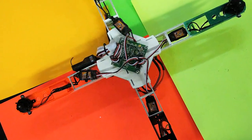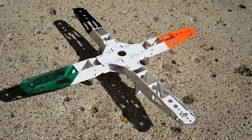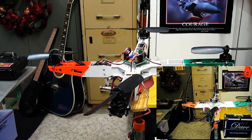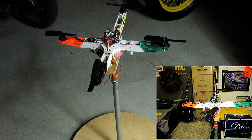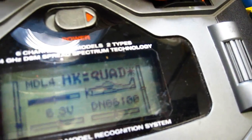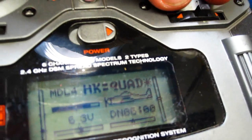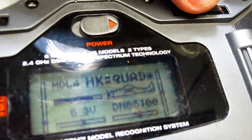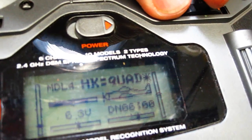I built a plywood frame with super glue and, ugly as it is, it seems pretty strong. I also found that this is a very touchy machine and way harder to fly than the MQX. I used my training helicopter test stand and had to do a lot of trimming. In fact, I did so much that my oldest DX-6i lost its aileron trim ability. From what I've read, it seems a bunch of other people are also having this problem, and my problem is not mechanical as some people say with broken tabs.